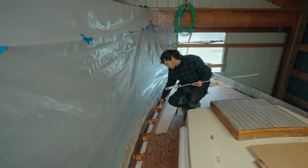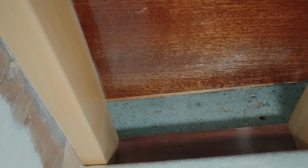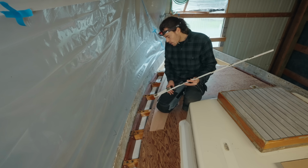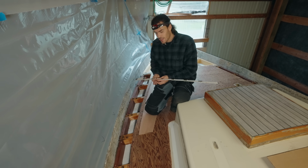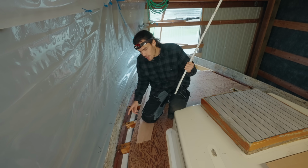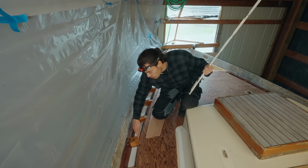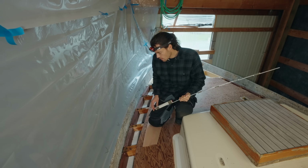One is that there still were visible repairs from underneath from the old plywood, so I wanted to get rid of those, and that allowed me to do that by bringing the cut further in a little bit. And then I also selected lengths that I can take out of a full sheet of plywood by always ending up with one butt joint on a big beam or a double beam where the bulkheads are placed.